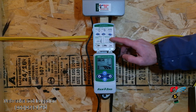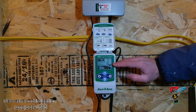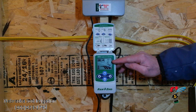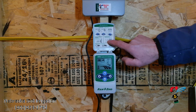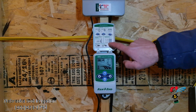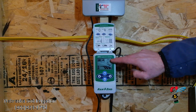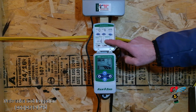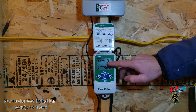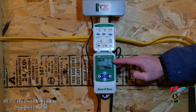The next icon is what they call rainfall set point. As the rain sensor on the gutter detects rainfall, you're going to have small dark bars filling up this rainfall set point. You can see how much rain they correspond to — if it only had one small bar, you'd have an eighth of an inch; if it was halfway up, you'd have a quarter inch; if it was all the way full, you'd know you had a half inch of rain. Right now, this is set for a quarter inch, so the system will be running until we reach that quarter inch mark.